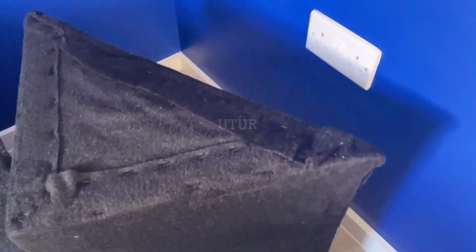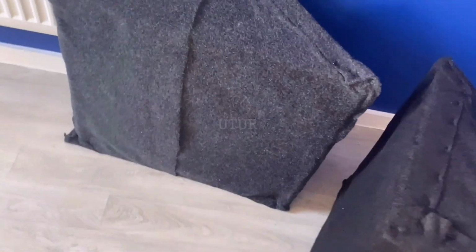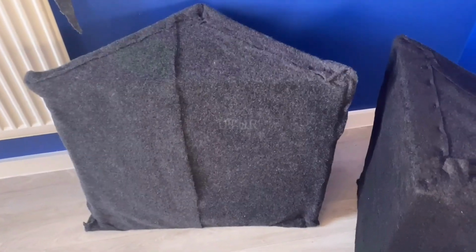Just take cognizance that the sound absorbing fabric ones will absorb sound frequency waves because they are thick and porous. Suffice to say, the waves enter into the fabric and become trapped in the fibers and folds and convert from sound energy into heat. Whilst the acoustically transparent fabrics are used to cover acoustic panels, bass traps and diffusers that are made of absorbent insulation.